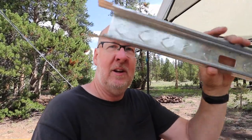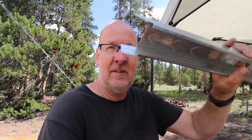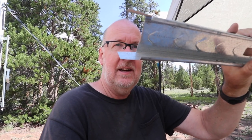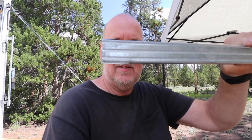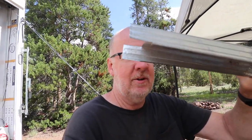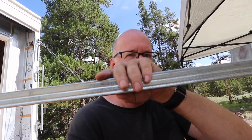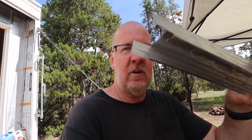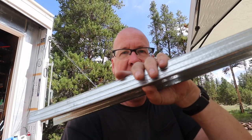Today I'm putting in internal supports — cross beams so the upper cabinet has supports to attach to. I've finished the first cross member. With steel studs, you put little flanges on the end so it sockets into the perpendicular vertical stud, then put screws through the tabs. On the other end you can put a flat piece and screw directly into the vertical stud using the flap. The flange method is probably stronger, but when piggybacking side-by-side, the flat method is better for a straight cut directly across.